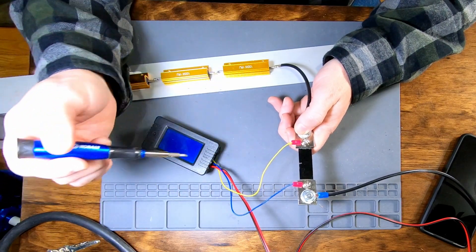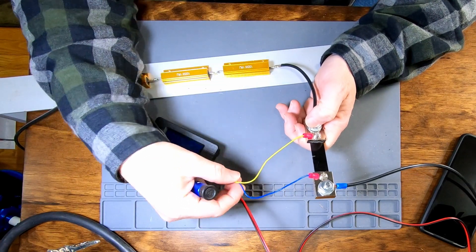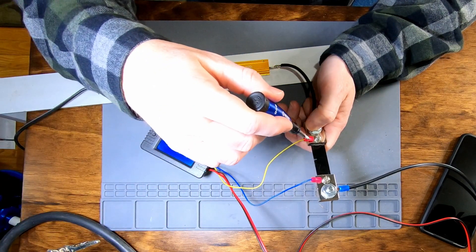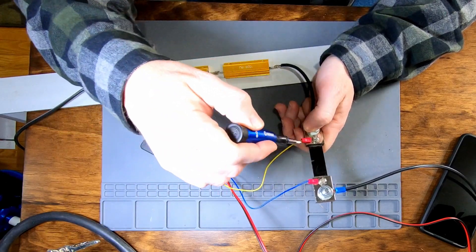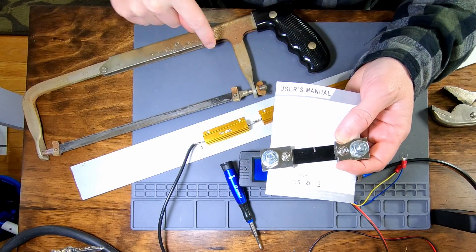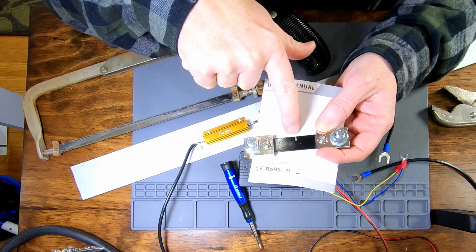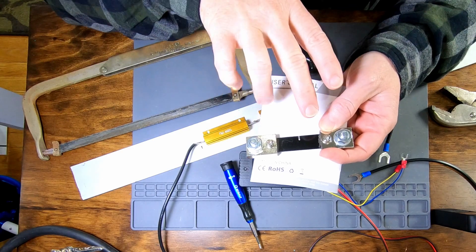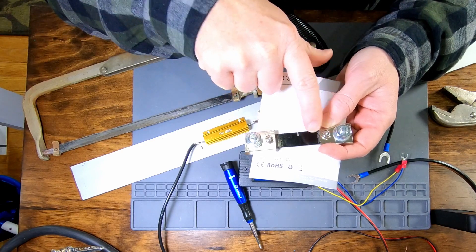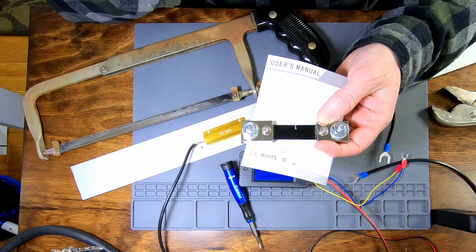Your best bet, honestly, if you need lower voltage for the same current going into the meter, is to lengthen these blue and yellow wires so that you get some voltage drop from the actual measurement point of the shunt into the meter. Okay, after a couple of swipes at this slot with old trusty rusty here, what we've essentially done is narrowed the shunt at the pinch point, which will slightly increase the resistance between points A and B, which for a given current flow will create a larger voltage between A and B. Hopefully that shows up now as a proper current reading on the meter.